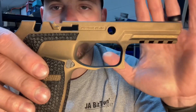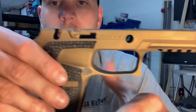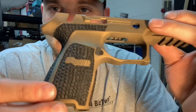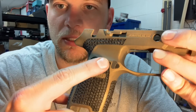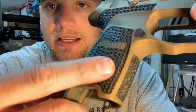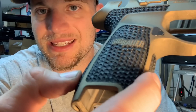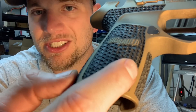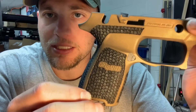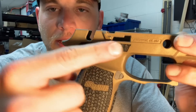It's nice and smooth and good as-is, but the front undercut still lets your off-hand get a little higher in there. Like I explained earlier, I cut this border in, brought it up a little bit higher than normal, and now it has this recessed action. I'll try to get in a little closer so you can see — the stippled part sits just slightly lower, to the inside of the part that's left cerakoted. It gives it a nice, clean finish.